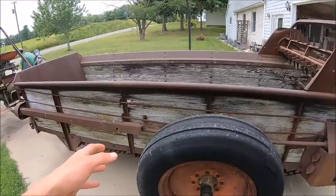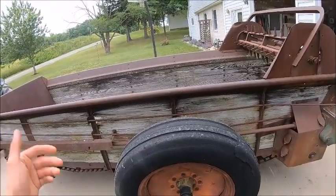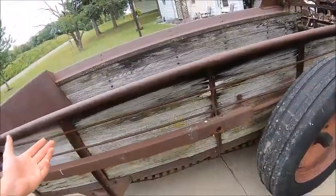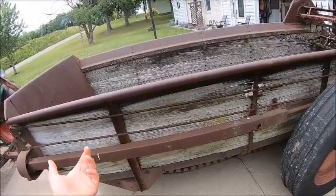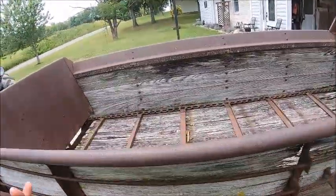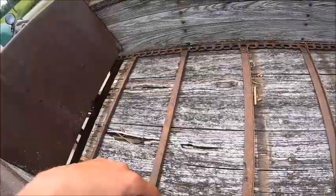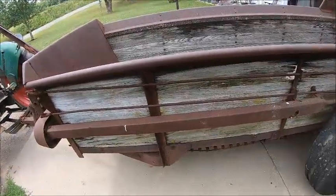But it's looking like it's going to cost me about 250 bucks for lumber, depending on getting all the same size boards. It's all 3/4 material, so if you go by the sale dimensions, it's going to be 1 by 8 by 12 is mostly what I'm going to need. Although it looks like the floorboards are short enough, I might be able to go with a 1 by 8 by 10, which is going to save me some money. But that's why I wanted to measure it before I bought any lumber.